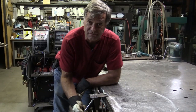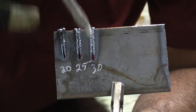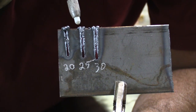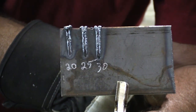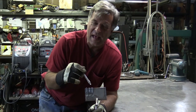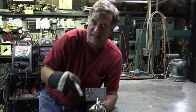Now let me flip it over and see how much dross or slag is on the other side — see if amps makes any difference in how the cut looks. You can see the difference: there's a big lump at the 20 amp cut. A little smaller at 25, maybe about the same. I don't see a lot of difference in the amount of dross on the bottom. So let me set this back up at 25 amps, but I want to change the air pressure. Let's see if pressure makes any difference in how the cut looks on the bottom side.